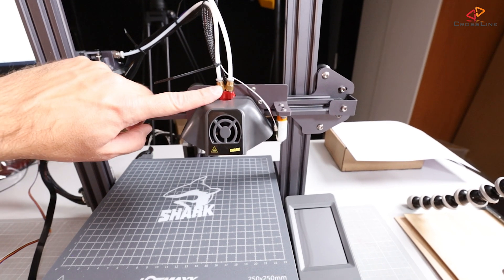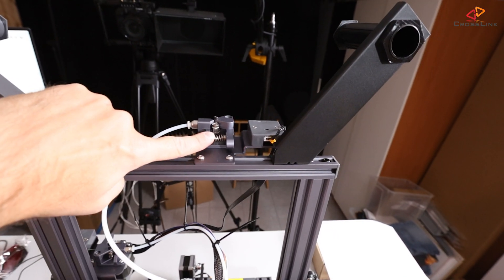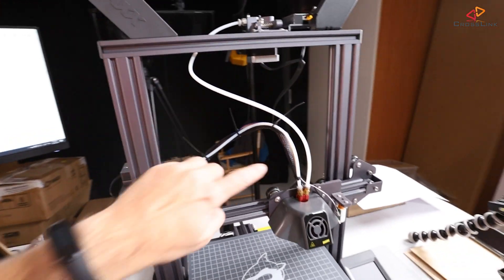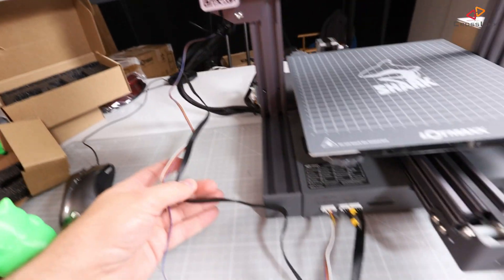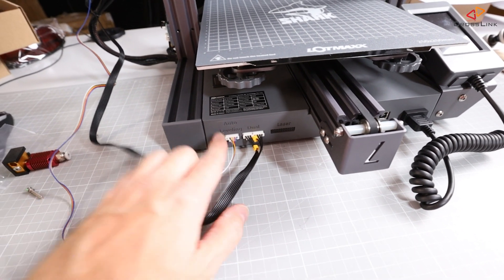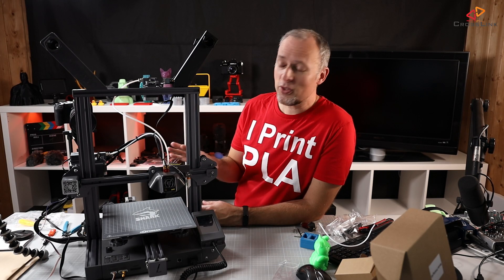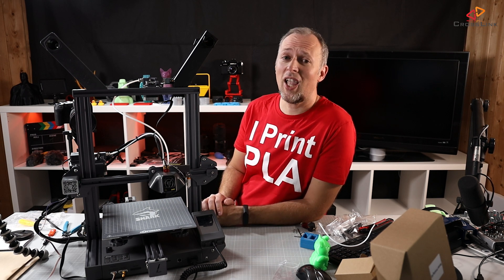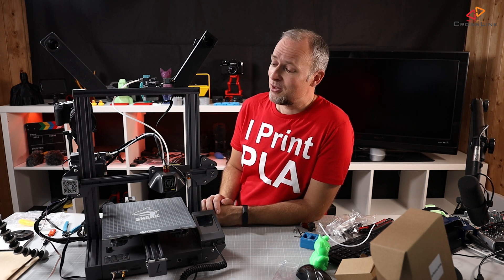After the upgrade: we replaced the nozzle, mounted a secondary extruder motor at the top of the printer, added a second PTFE tube, and all cables are routed to the side cleanly, plugged into additional ports. Hopefully the dual color printing setup is working. I'll show a first dual color print in a moment, and by end of October the full 10-minute review of this printer will be posted — covering what happened in these two weeks, what went wrong, and what the pitfalls were.